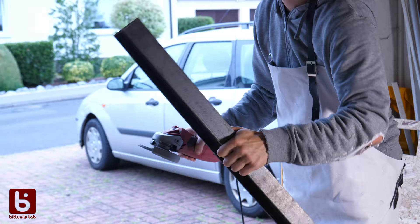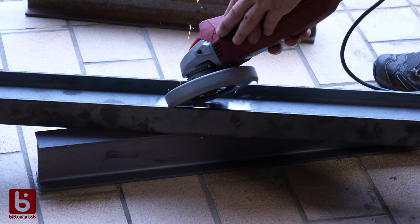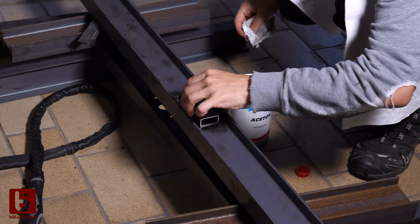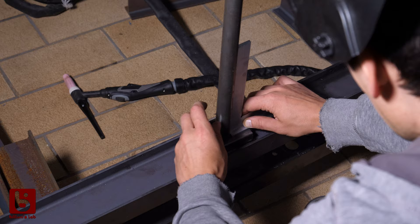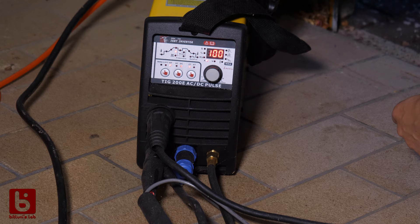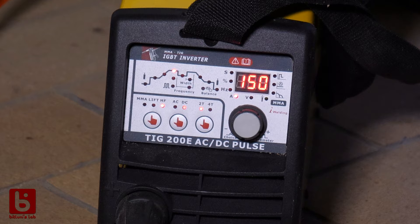First of all, secure your gas bottle. Using a flap wheel, the welding areas need to be ground shiny and cleaned with some acetone. I have used tables for the current settings before, but this time I tried starting low and going higher if it's not enough — that worked for me. Since the I-beam is solid 5mm thick, I used 150 amps to penetrate it deeply.